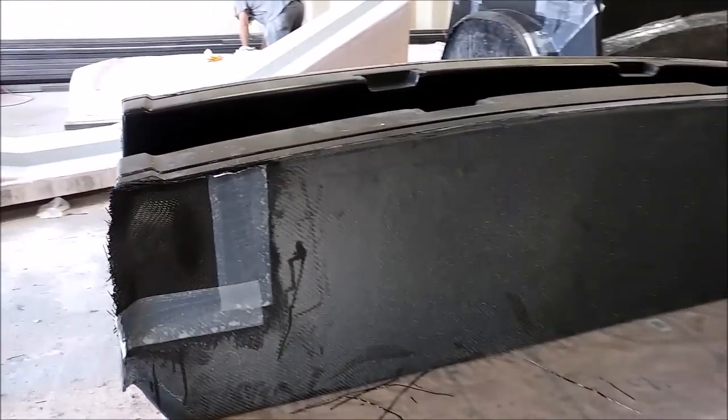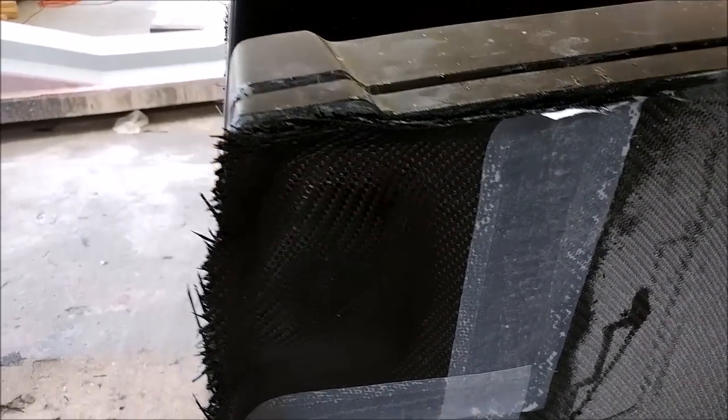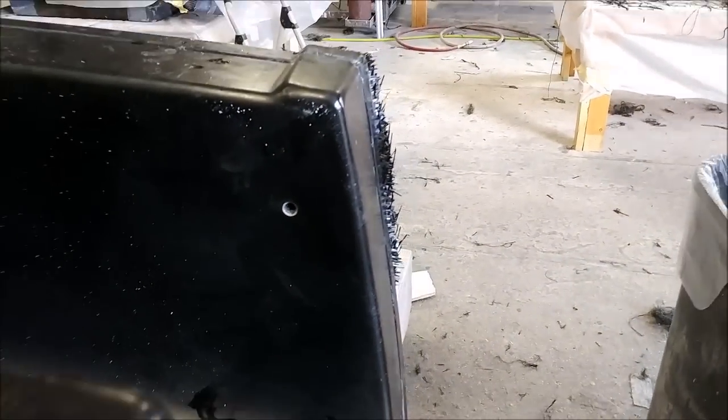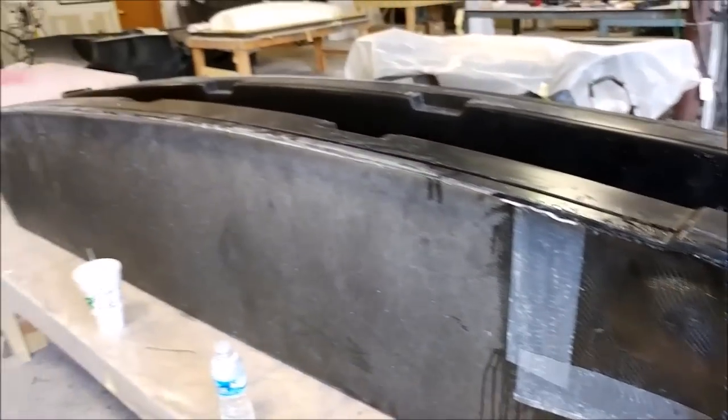Next up is the mold for the keel. We had to put some bushings in place for where we drilled a hole for the rotational point for the nose gear. We bonded some FR4 — one inch thick — on the sides, aligned it up on the machine, drilled it through, and then put some carbon fiber to keep that in place.